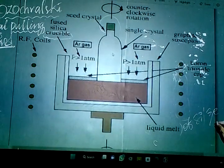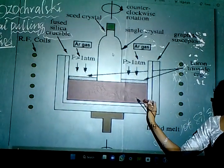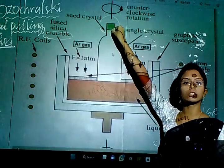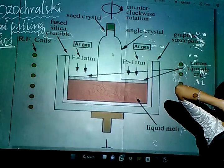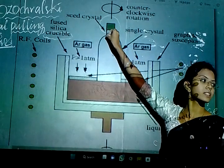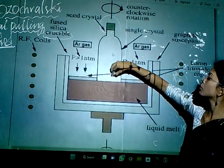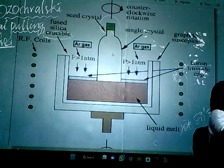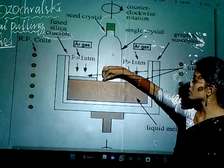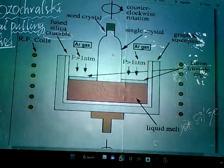When the process starts, we produce heat for the crucible. The seed crystal placed on top moves downward into the melt and then is pulled back upward. It moves up and down. When the seed crystal reaches the melt surface, the crystal begins to grow.